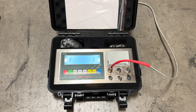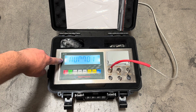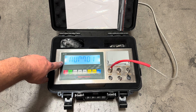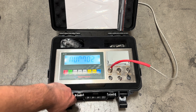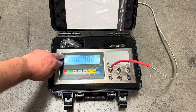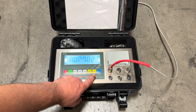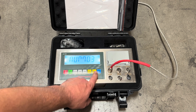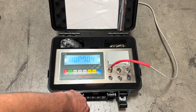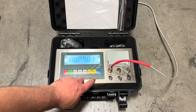This is going to take us to F1 and we're going to go ahead and hit the print button. This will tell the display to show how many pads we have connected. Right now we just have one, but if you had a two pad system you would want the display to show two pads at the same time. You would switch that to two by hitting the store button, or three for an aircraft scale, or four for a four pad system. For this demo we're going to leave it at one and hit print.